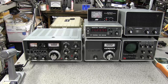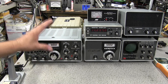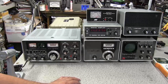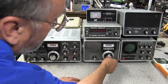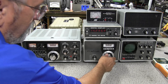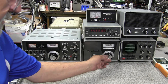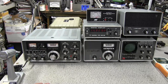We need to go through the digital display — there are some capacitors in it that are going to need replacing. Got to think about how old this thing is, it's been around for a while. We also need to break into the VFO and do some cleaning and lubricating. It seems to work fine. The VFO works good, but when you tune the capacitor it's a little bit stiff — not great — and it's probably some old grease in that drive that needs to be cleaned out.